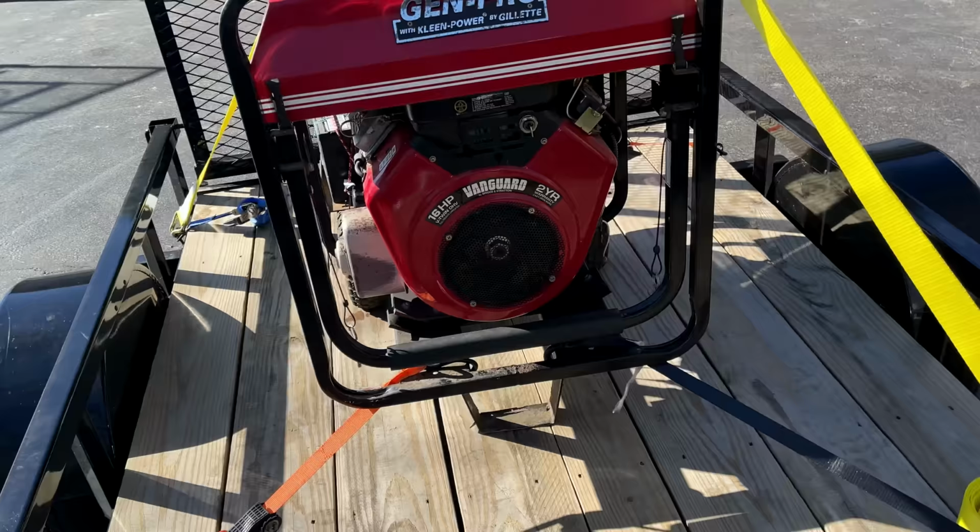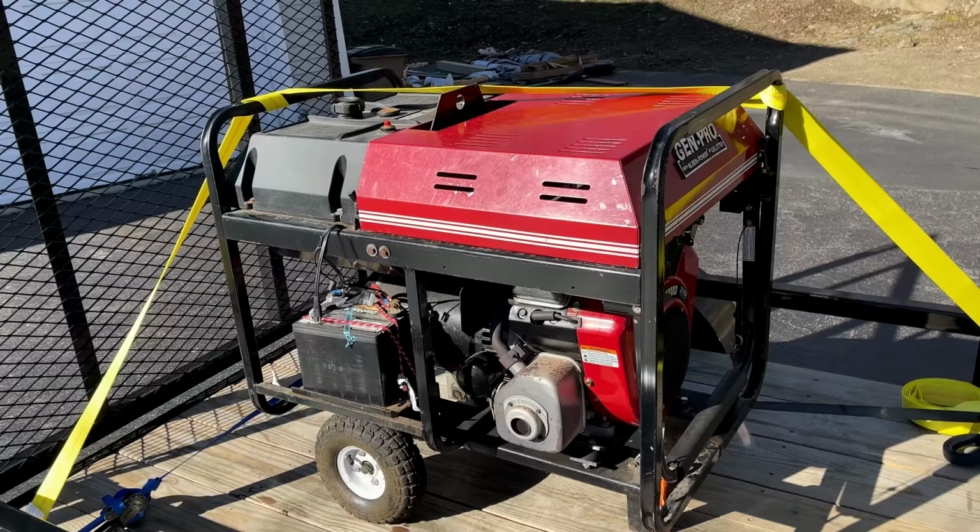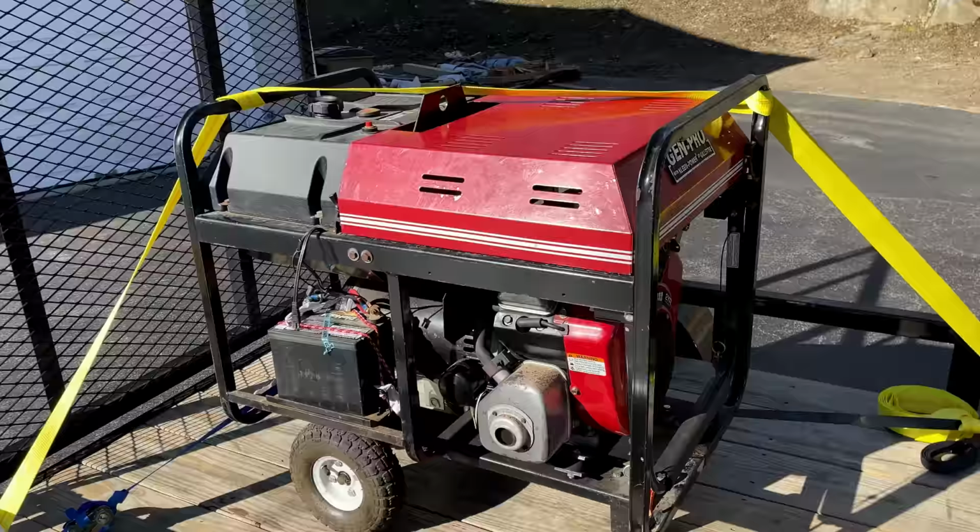Now this actually doesn't belong to me. A local subscriber tracked me down when it stopped making power. He said he was running it, it had no load on it, but it went under load, and that is never a good thing. That's usually a sign that there is an issue in the stator, but that's what we're gonna find out. So let me get this off the trailer.